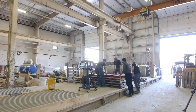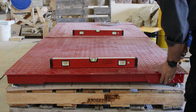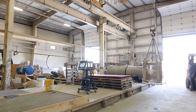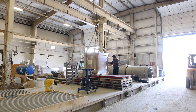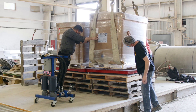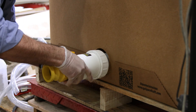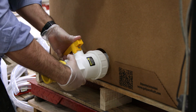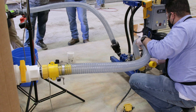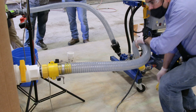Industrial floor scales are placed and leveled. For the scale of this project, a 4,400-pound tote unit of VitaFlex 60 will be used. Each component weighs 2,200 pounds and is carefully hoisted and placed on the scales. Valves are carefully connected to the individual totes. Two-inch diameter reinforced hoses connect the totes to the meter mix machine. The EZ-Mix machine has two separate pumps, one for side A and the other for side B.